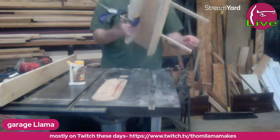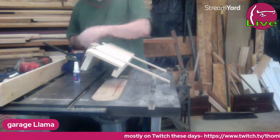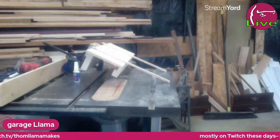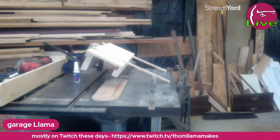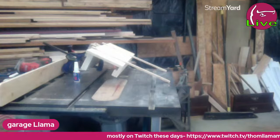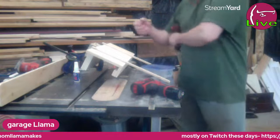Come on. And it's about perfect. I think what I can do, if I don't break it, is put a couple screws from the back into it. What do I have for screws? Anything like 2 inch or smaller. Anything over an inch, inch and 5/8, inch and a half, inch and 5/8 trim. I think inch and 5/8 will be all right. And I need the little trim bit, which is right here. And we'll impact that puppy on there. How does that sound for a deal?